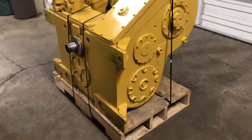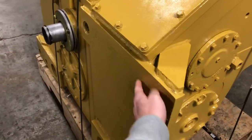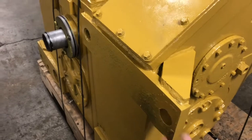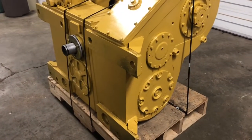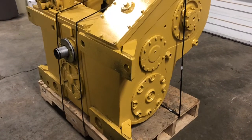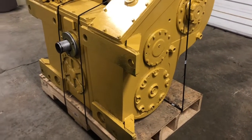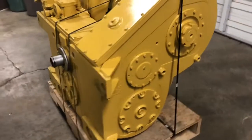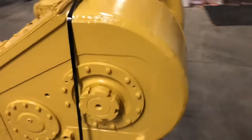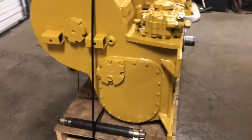There she is, finally done. A couple of things to note when you're installing it: make sure to get all of the paint off the back, buff that all real smooth so it's metal to metal — nothing to get loose. You don't want one of these winches flying off the back of a Cat when you're pulling 80,000 pounds. All cleaned up, all looking good. The key is that now it works.